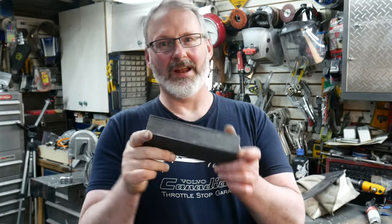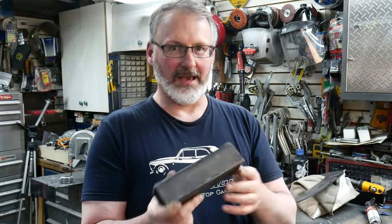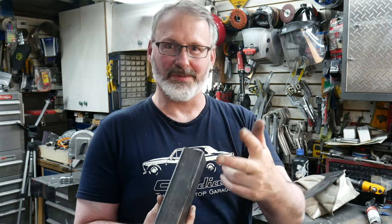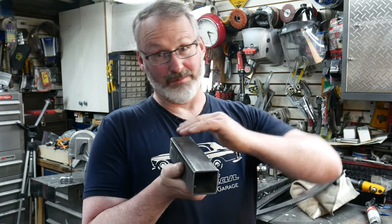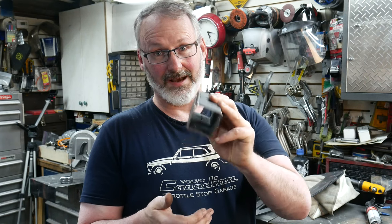I hate mill scale — there's just no getting around it. It's on any of these hot rolled pieces of tube, flat plate, and other things you're going to use for your projects. It needs to be removed prior to painting, prior to welding, prior to all kinds of processes. Mill scale is diabolical. It's like 100% contacted with the steel — sort of bonded in there. All it is is iron oxides and other stuff that's floated to the surface during the processing of the steel.